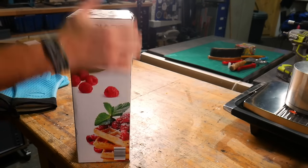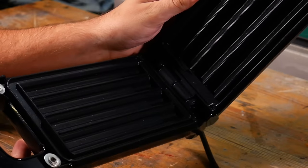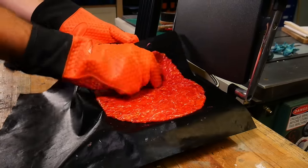Right on to our intermediate pen blank. We stumbled upon this idea when we were in the supermarket and saw this churro maker on the shelf for eight pounds. It's essentially the same type of machine as a panini press but instead of a flat plate it makes four churro or pen blank shaped objects at a time. We thought this would be ideal for making pens. Because of the shape of the slots in the churro maker it's quite hard to melt the plastic directly in the machine, so we used the panini press to melt the plastic first and then used the churro maker to shape them into blanks.